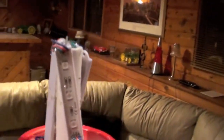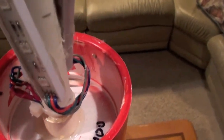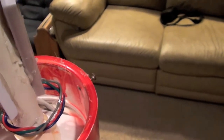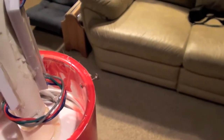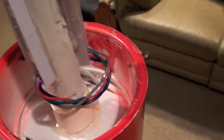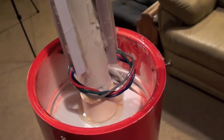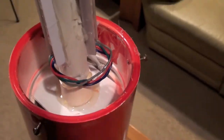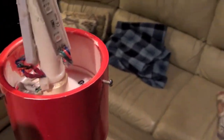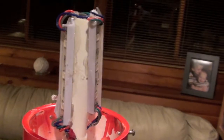Here we have our 5050 LED modules — I have three of them on here. There's a piece of PVC water pipe with an end cap that has a flat surface on the bottom. I glued the end cap onto the PVC, then glued that to the little Coro holder — which in Chuck's design holds the incandescent light socket. On this one it's holding up the water pipe, and then I glued the 5050s with hot glue onto the water pipe.